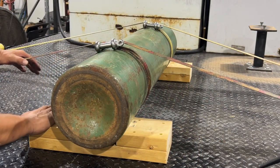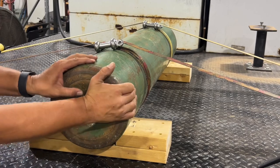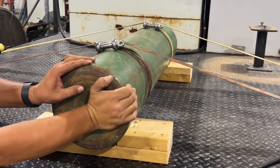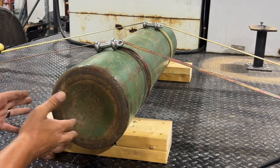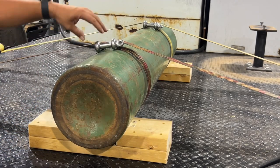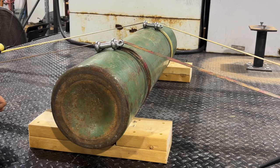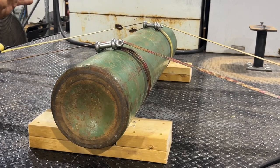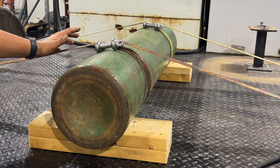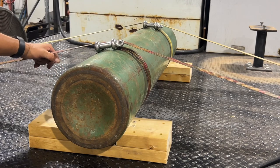Now that we've got our saddles in place and we've got our straps routed with our D-shackles, this load has become very, very secure. In fact I can shift this whole thing and it moves the truck instead of moving the load. With the added friction from the saddles it keeps it from moving side to side, and the way we routed around using the D-shackles it is both pulling it together and pulling it down at the same time. So with the two straps on there there is no lateral movement either. This has turned what is a cumbersome load into a very, very secure load. This is how I transport all types of gas cylinders. My name is Ben — you've been watching the Texas Tool Crib. I appreciate you watching and I'll see you in the next one.